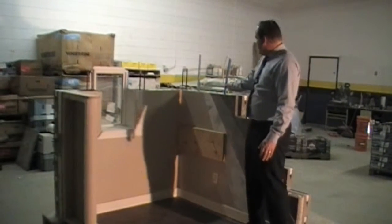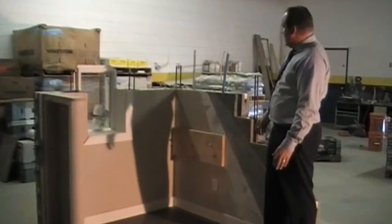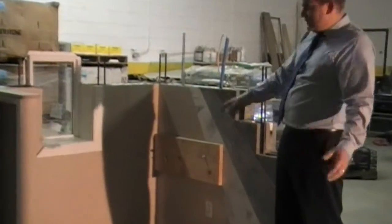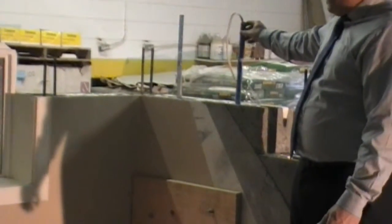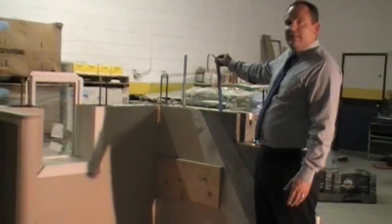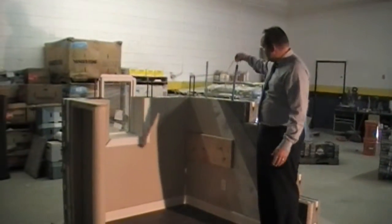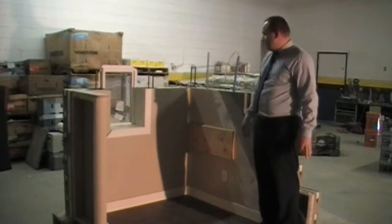The other big component is electrical. As you can see, there is an electrical outlet down there. As you're building, you understand where to put your boxes — you cut out a little area as you build the block, slide in your electrical box, and then run a plastic or metal conduit up through the entire wall. Once it's done, the electrician just takes the wire, feeds it down into that conduit, ties it all in at the end, and everything works really well.